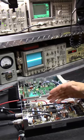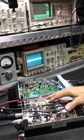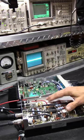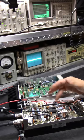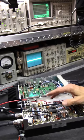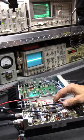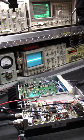The reason I didn't want to do a video is it's not performing like brand new and it's kind of dirty. Dirty comes in a lot of different ways. Just over-modulated, that's just one small part. Intermodulation distortion, and harmonics, that's a whole different animal too. This ain't the cleanest thing on earth. It's more than likely going to be the transistors. It's factory. They weren't beta matched, okay? The curves. Yeah, they're from the same batch, but that doesn't mean as much as beta matched. So you'll find and see harmonics. Hope I remember to show you that.